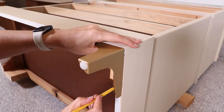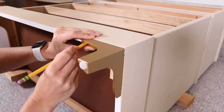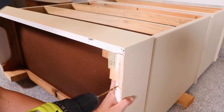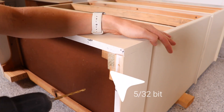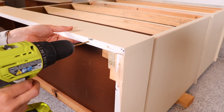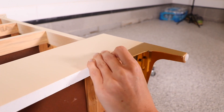Now I'm getting ready to attach the feet and new hardware. I got each foot in position, marked off the holes with a pencil, then drilled pilot holes — I want to be careful not to crack my base because I'd have to completely redo it. A pilot hole just drills in a little bit to give the screw something to go into, letting you go slower and not be as aggressive. Then I got the foot back in place, put the screws in about halfway, got all four in, and tightened them down.